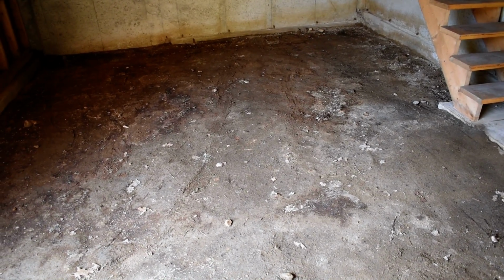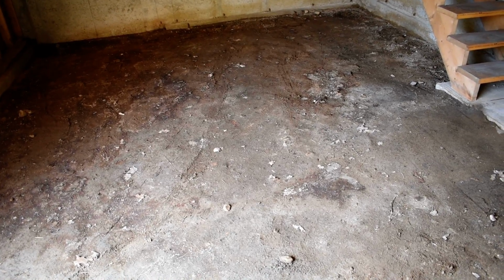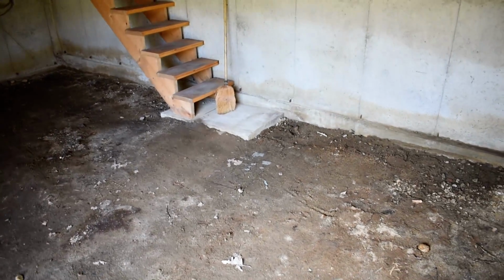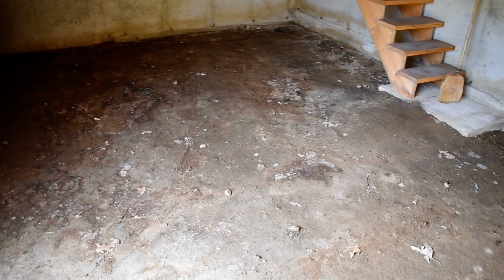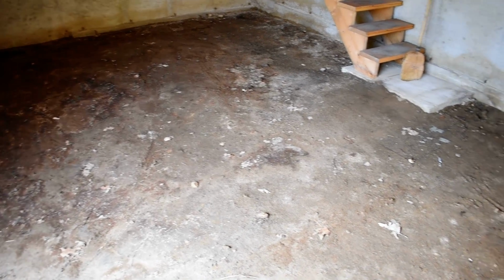We are also doing down here, we'll try to film this after they prep everything, but we're going to do vapor barrier down to keep it more dry. Again, it's wood shop upstairs. I don't want stuff rusting or even the wood stock that I might have up there absorbing water on a rainy day or anything like that. So we're going to vapor barrier this and the garage next door. We're going to have them do rebar, so it's going to be a bona fide shop floor.